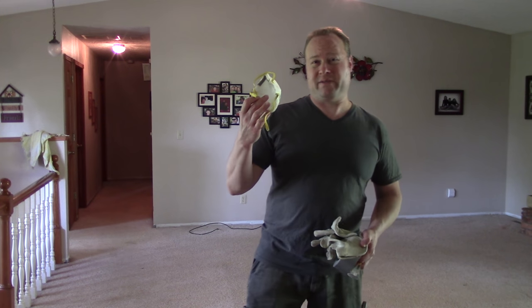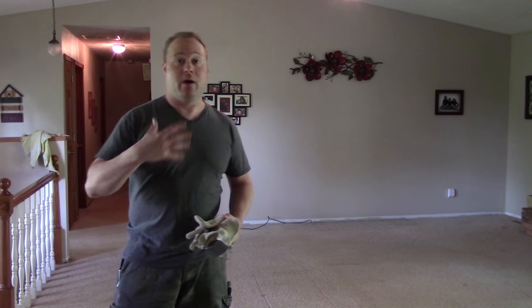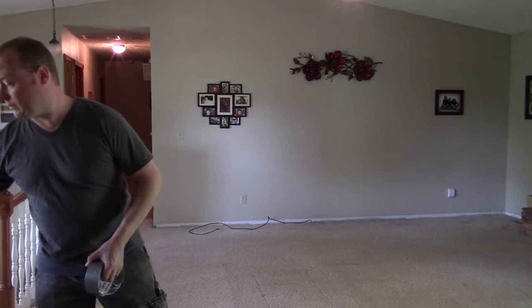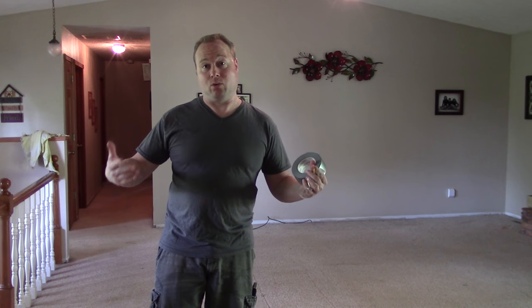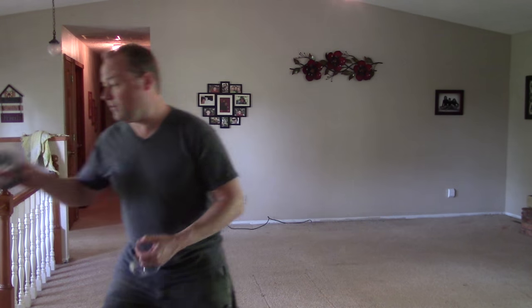A couple of things we're going to want today: I have a dust mask. Old carpet has a lot of allergens — pet dander and so on. When I pull it up, it's going to be puffing everywhere. I already started to get a sneeze attack yesterday from pulling the baseboard up. I'm also going to use gloves. There's a tack strip underneath this and we don't want to get stuck by old rusty nails, so I've got leather gloves, some duct tape — this will be for binding it up later — and safety glasses and a utility knife.